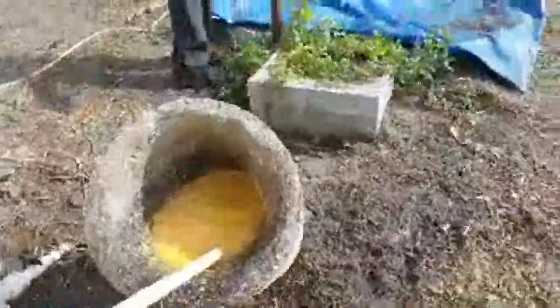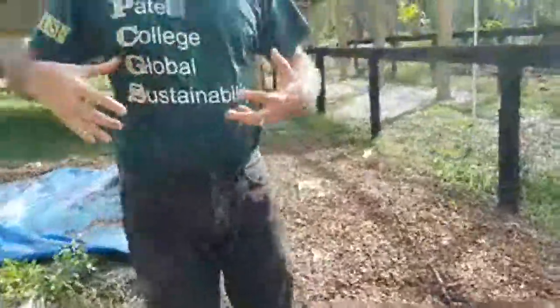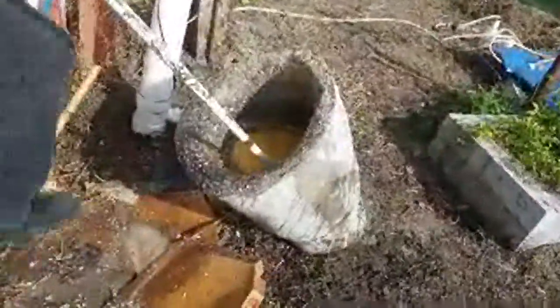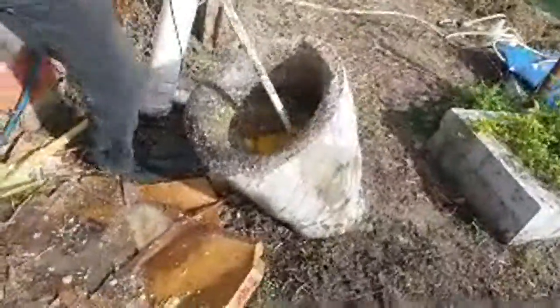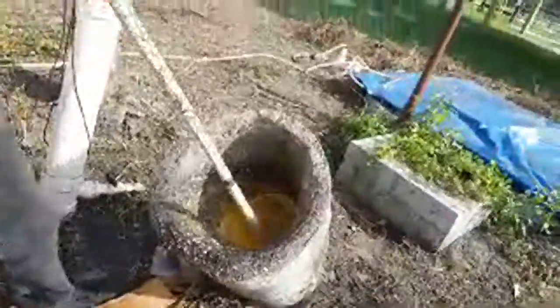So what happens also, because it's the winter time, is that condensate, right? So the water that's in those lines is because every night the vapor condenses, the water vapor, and just clogs up the lines. The only thing is I don't want to get this caught because it's hard to get out. So I'm using a plunging motion.